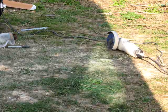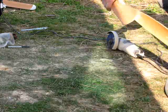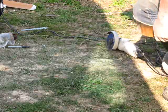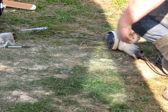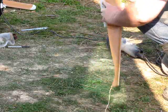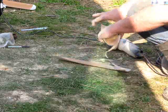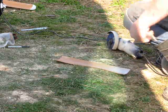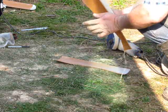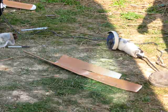Just for those people that are still worried about this PVC pipe — it very much depends on what you source. Here's an example of how I'm trying to break this scrap up now. As you can see, there's practically nothing I can do to snap it. The thing that might be important here is the temperature today — it's quite warm. When the blades previously shattered, it was December. So temperature obviously has a large bearing on how this material performs. Okay, that's it — a real quick one.